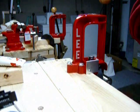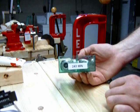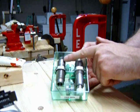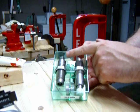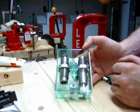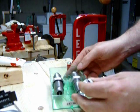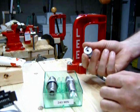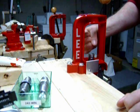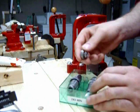Next, you are going to be needing rifle dies. This is a .243 Winchester set of rifle dies. Rifle dies usually come with two dies: a resizing die that resizes the case to the original dimensions, and a bullet seating die which seats the bullet and can also crimp the bullet in place if you want. You also need a shell holder, which goes into the press and keeps the case in line with the die so there is no play in the case. Must-have item.